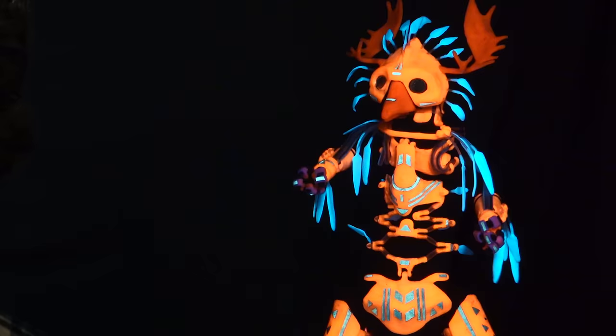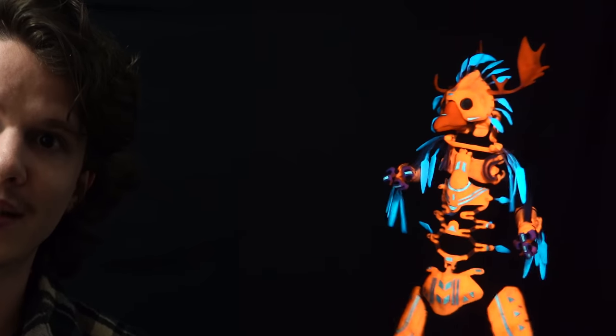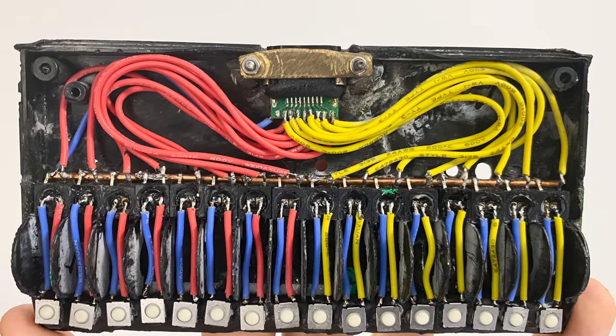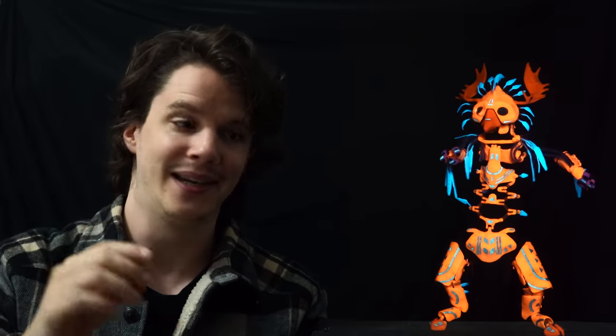I'm keen for this puppet to use his arms. The tricky thing about that is, if you take these two fingers and push against your palm you get a sense of how much force you can exert — try it the other way around and it's a lot harder. That's how his arms are actually articulated. So I had to swap out the tactile switches under the keys for some lighter ones. This actually had the added benefit of reduced key travel, meaning there were gaps appearing between the keys where he was getting his dangly bits caught. Less key travel, less trapped dangly bits — it's a good thing all around.